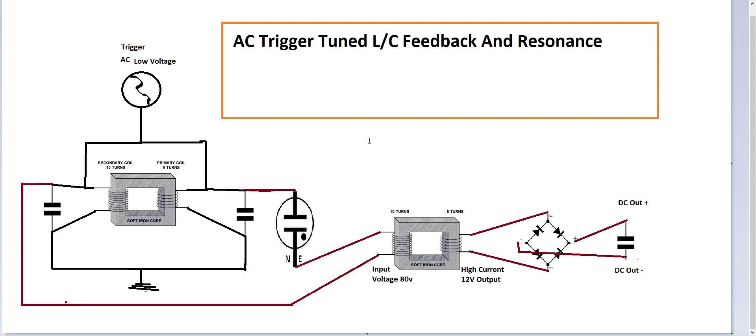This is an alternate schematic showing one way of doing this using regular AC sine waves and a tuned LC resonant circuit. My original version does it a little differently — it uses back EMF as a trigger pulse — but it uses similar principles of feedback and resonance. I hope this sheds some light on what I'm doing and points folks in the right direction. Thank you.